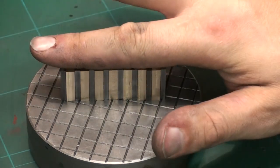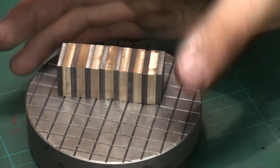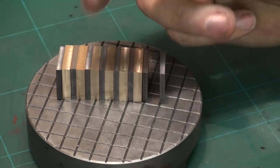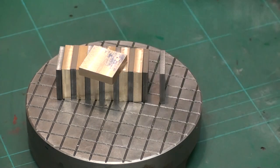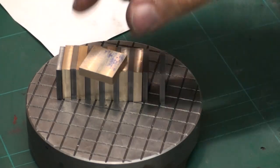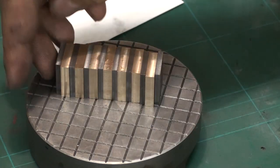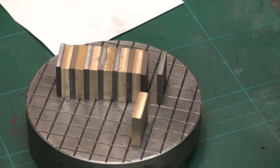I like the laminated version more than the pinned version, more common here. But this will get a precision ground magnet. So we'll take these brass blocks and drill them in the center 8mm diameter so we can glue in these neodymium magnets. Then we will end up with a hopefully awfully strong magnet that we can grind on all surfaces. So let's drill these brass plates.